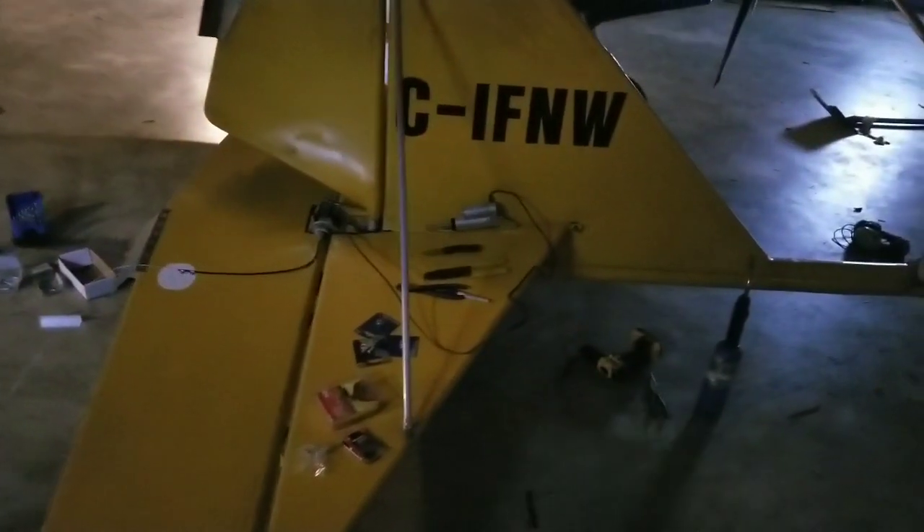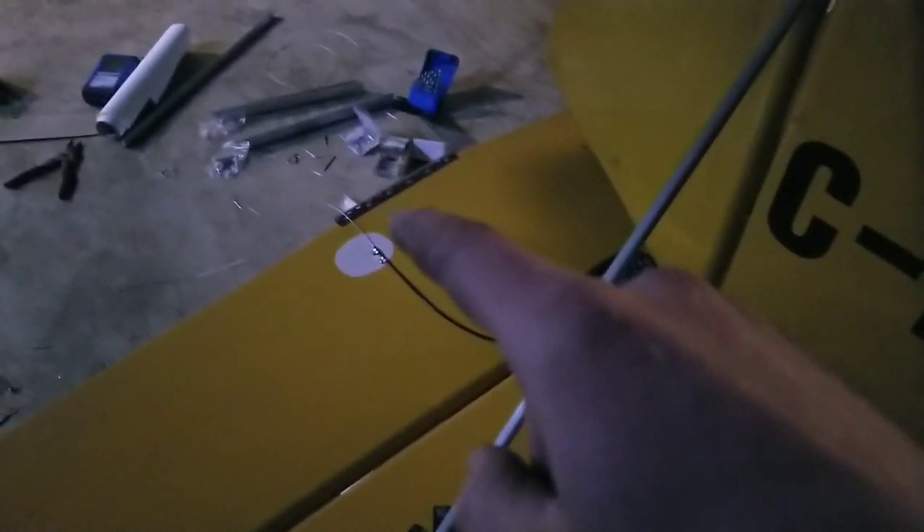I'm just in the process of getting it wired in. I ran a wire all the way through the boom tube so I don't have anything on the outside of the plane, which is kind of nice. I just made a couple connections and did some heat shrink on it, and I'm going to pull all that slack up through now. Then I'll be mounting my tail piece attachment and figuring out my cable attachment to the linear actuator.